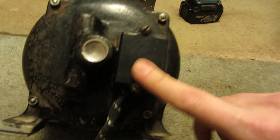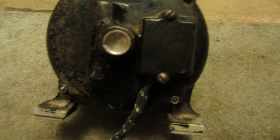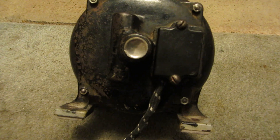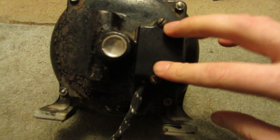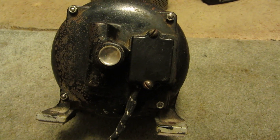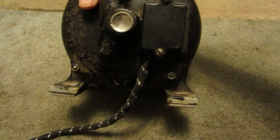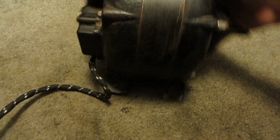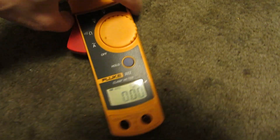There's not much to see on the outside other than its power goes into this box here. I'm going to completely take this motor apart and show you guys the inner workings of it. But this isn't just an electrical box — this actually houses the brushes that run this motor. It's not a repulsion start induction motor like in my other video. It's something different, and that's kind of why I'm doing this video because I'm not quite sure what category this motor falls under. But I've got it hooked up to power. I'll run it for you guys — I'm going to fire it up slowly off my Variac. You can see what the amperage does and all that.